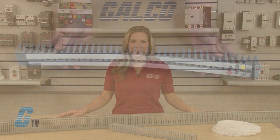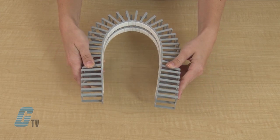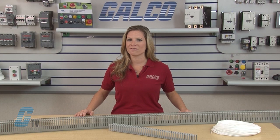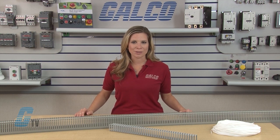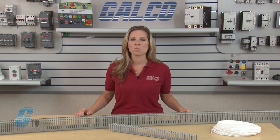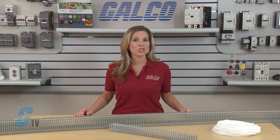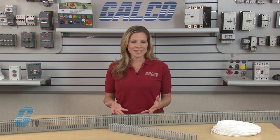The Q-Flex is a flexible wiring duct made of plastic, insulating, shockproof, self-extinguishing material in compliance with UL 94 V2 standard, and resistant to a permanent temperature of 80 degrees Celsius and peaks up to 110 degrees Celsius in compliance with IEC 216 standards. They are resistant to acids, oils, and greases.